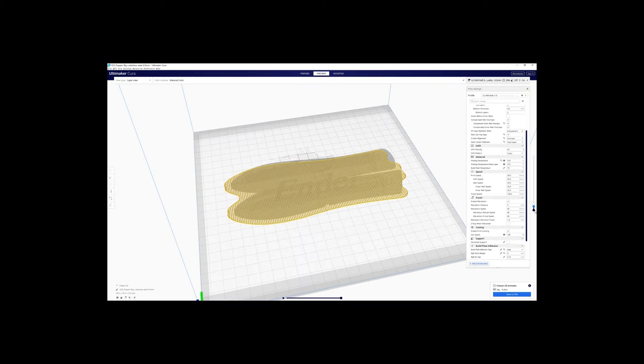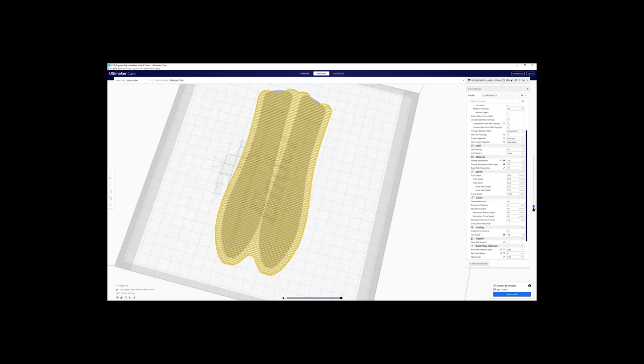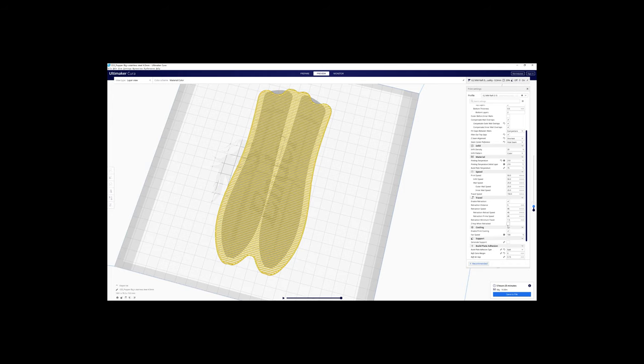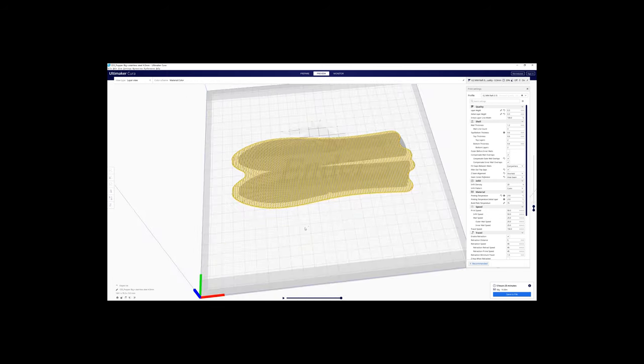This is the 3D slicer setting. I'm using a raft for better surface adhesion. No support needed. The printing temperature I'm using is 210 degrees. The printing temperature is really dependent on your filament type and the manufacturer. The filament I'm using is PLA. I got a much better result from PLA than ABS. ABS is too difficult to print and not as strong as PLA.